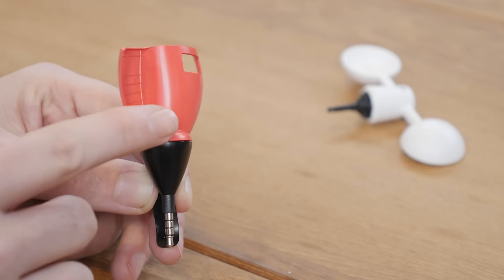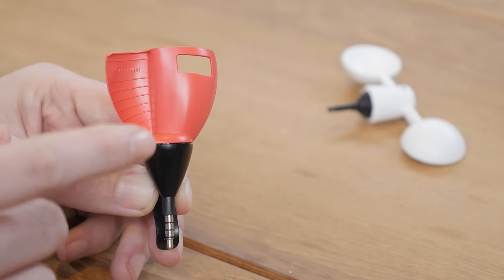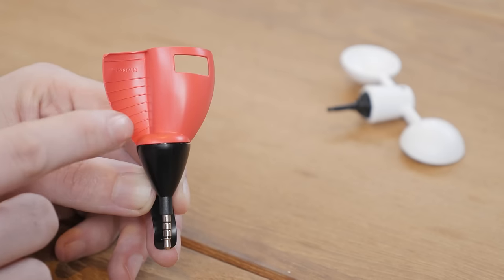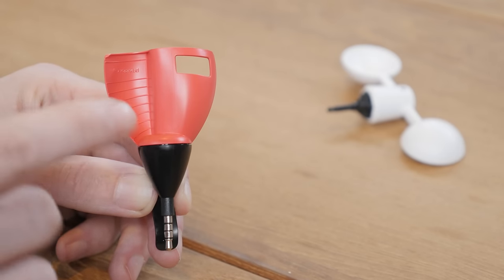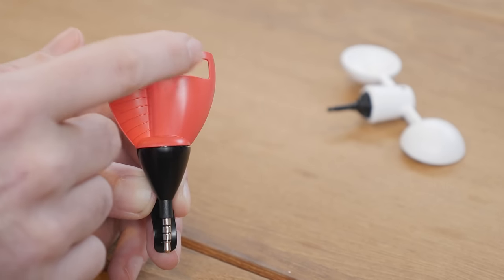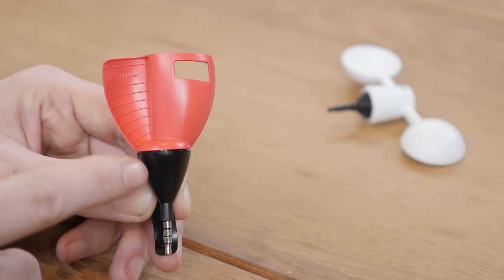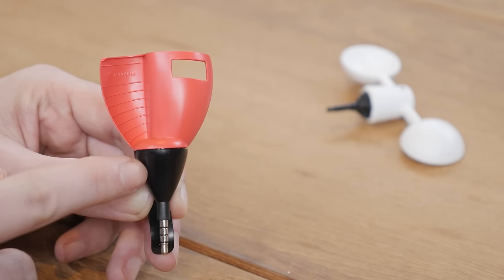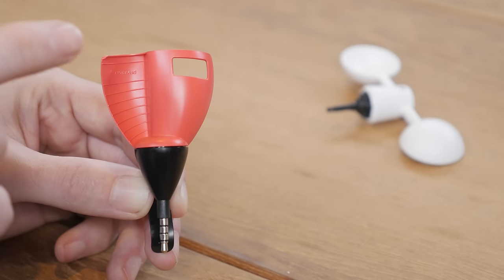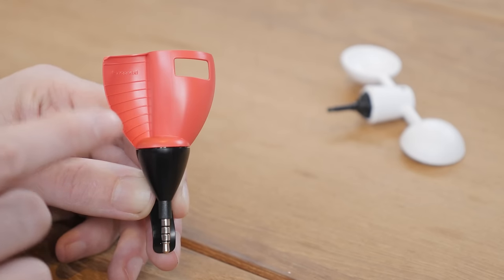But how do you think this thing is able to measure wind direction? You might have noticed that there's no big arrow-like appendage protruding out of this like you would find on most wind meters that are able to measure wind direction. Well, it's actually very clever. By having an asymmetric rotor — caused in most part by this hole here — and a sensor that's able to measure variations in rotational speed, the app is able to calculate wind direction plus or minus four percent. That is awesomely clever, and it's clever and innovative solutions like this that startups do so well.